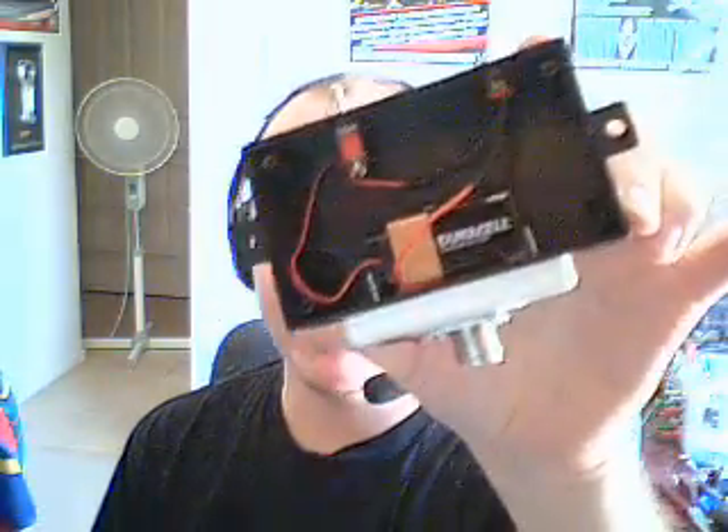Very easy little project to build. It's actually a good project for — say you just got into radios, if you're an F-call or even a CB'er — you know, you need this sort of stuff. You're going out on a field day, setting up a few hundred antennas for a field day, as we do. Very easy project. That 9V battery will last forever — well, not forever, but you know. The only thing you have to make sure is that resistor in there — you can't see it because it's inside some heat shrink — that resistor has to be the right value for the voltage from the battery to the LED, otherwise you'll pop your LED. But that's it guys, pretty easy. Alright, take it easy and hopefully catch you down the track. 73s.